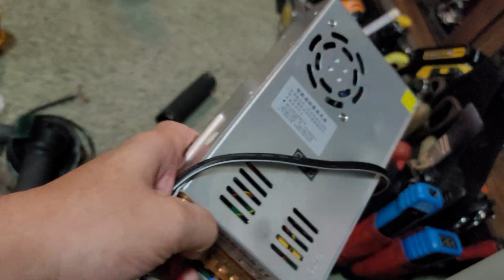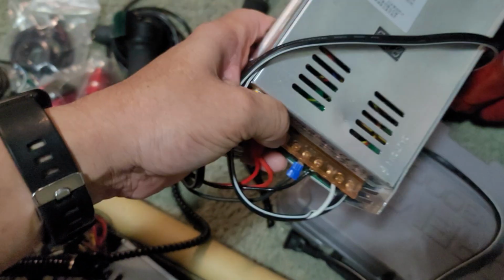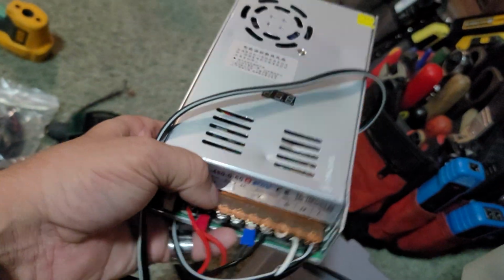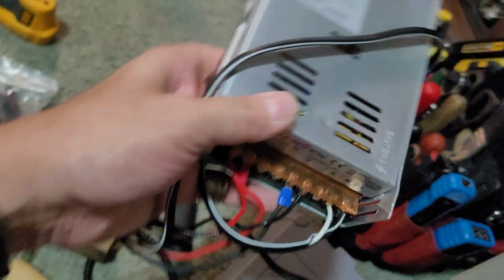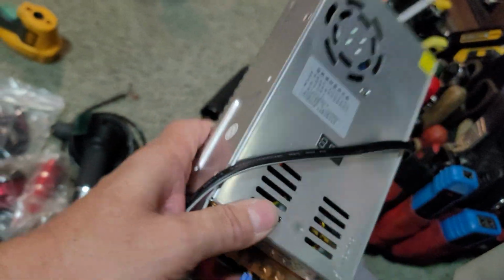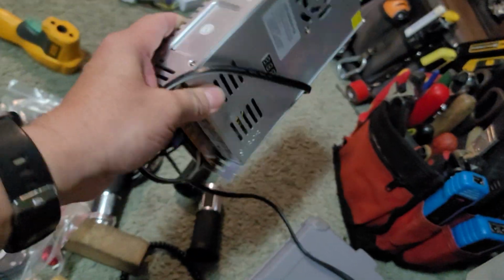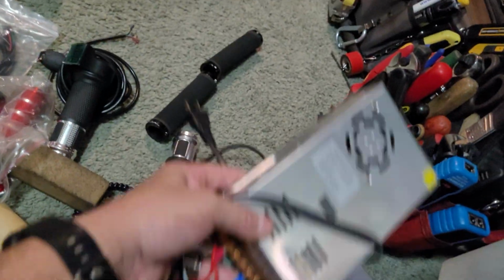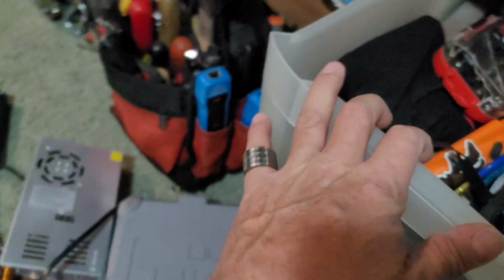Yes, you can use this if you have a BMS in your battery system. That's all you need. That's going to stop your batteries from getting charged when they reach the cutoff point anyway. So you don't need a $350 charger. That may come in handy if you're running battery systems without BMSs. Some people do. It ain't always necessary. A lot of people do.